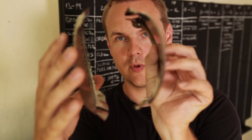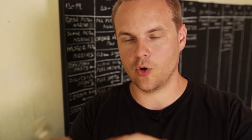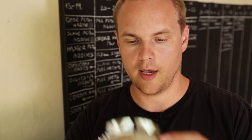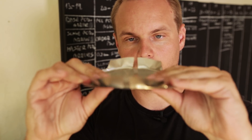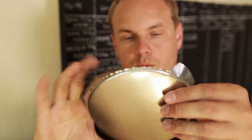I have here the first two parts. When you look at the shape it doesn't look very encouraging, but this is just the first test of the radius we can use for bending. With this test we were able to decide on the thickness of the metal, because we want to use as thin a metal as possible without losing structural strength. We now know that 0.1 millimeter is too thin — it's very springy and not rigid enough — and 0.2 millimeters thickness will be perfect. It's still a little too soft, but it will be possible to reinforce it by pressing some circles into it.